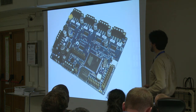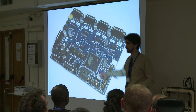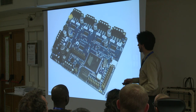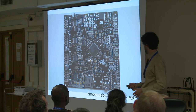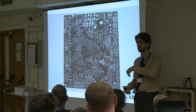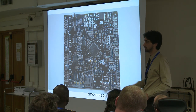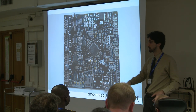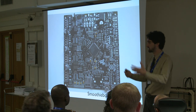This is a new electronic board. This uses a different architecture because it's an Atmel chip with ARM architecture. So you need new software for this one. This is a very good board with a good thermal design. This is another new generation board. It's a Cortex ARM architecture, very powerful. You can put an Ethernet plug on it. You can write software to have a web server on it and control the printer from the web. So this is evolution. And this is still open hardware. You have the designs of this board. You can download the design, see how it works, modify it, and even sell your variations if you respect the license.